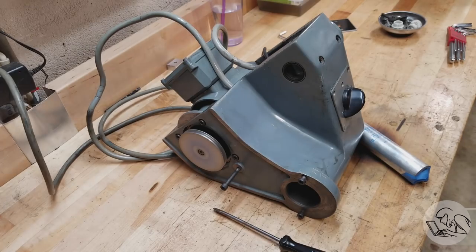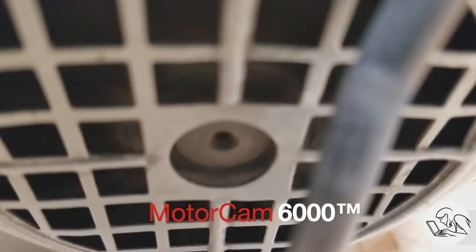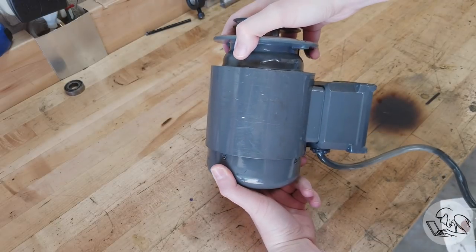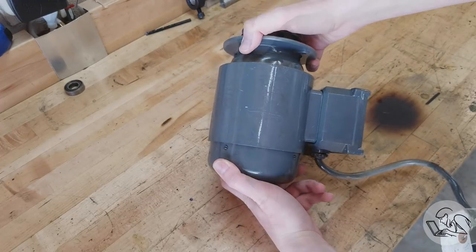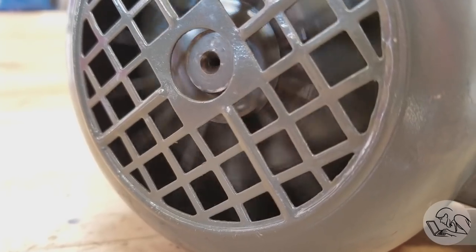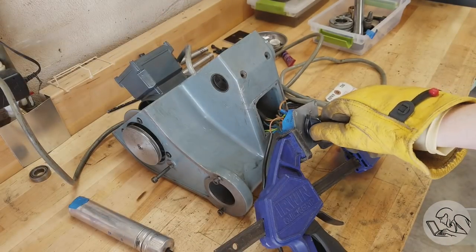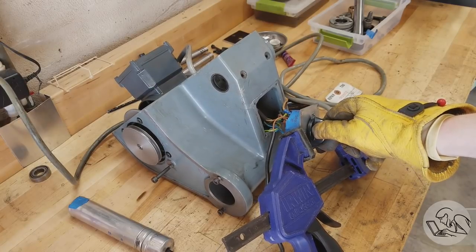It does sound a little bit noisy, though. I'll bring you in close to the back here so you can have a listen — I think I hear bearing noise in the back of this motor. So since I have the whole thing apart anyway, I might as well do this right. I packaged it up and took it over to an electric motor shop and had them rebuild it. I don't really have a big enough press to try and change the bearings myself, and there might be other things wrong in there. Got it back from the motor shop — now it's quiet as a mouse. One more mock-up with my test rig and now the motor runs beautifully. Sounds fantastic. So now I can take it apart and reassemble it for real.